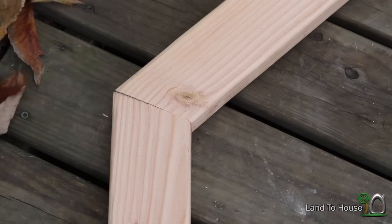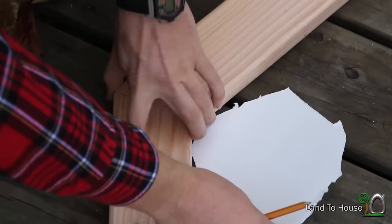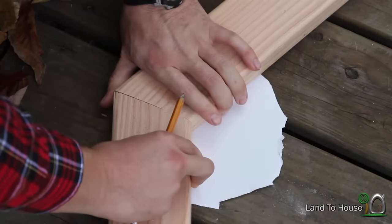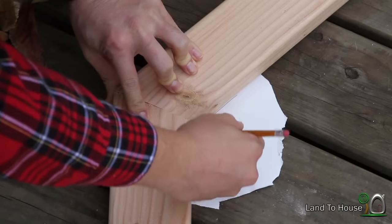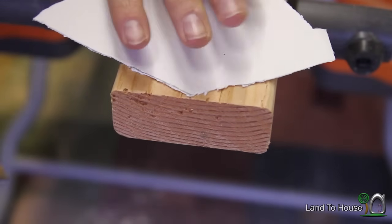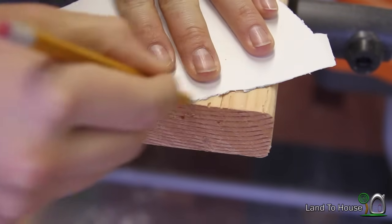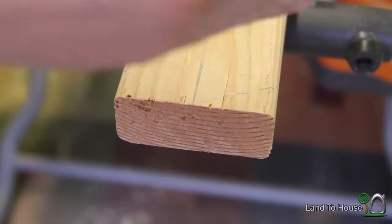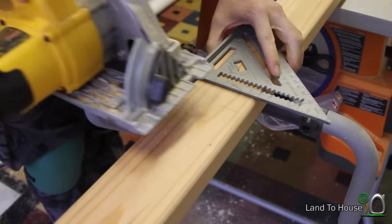I'm sure there's a super easy way to find this angle right here, but I don't have a miter saw, so I'm going to use a piece of paper plate — very low-tech — and make sure our top pieces are very well aligned, and just use a pencil to make a template of that angle. With this highly precise template, I just mark the general lines of where this middle cut is going to go. And now just cut this at the one foot mark we made earlier.